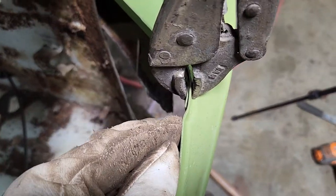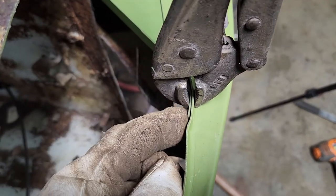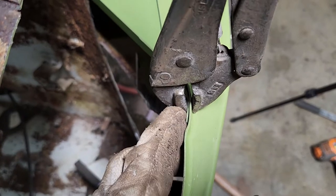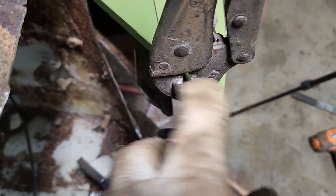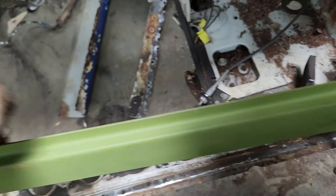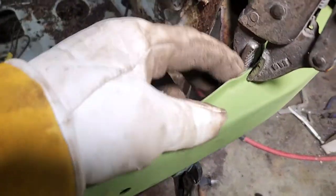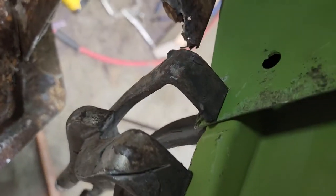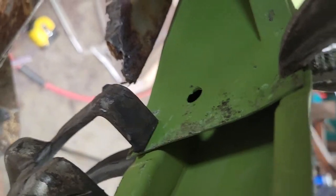There's a notch right here that the frame rail will go into the floor rail, and with this notch in here that the KF Vintage put in, the floor is going to go right from here, and it's going to be nice and smooth to this point. But this is still off right here, so this part might have to come down a little bit more, but I got it to line up there and right there with a little bit of hammering and dollying.